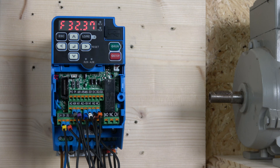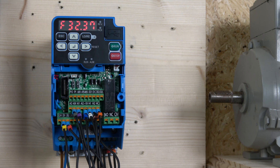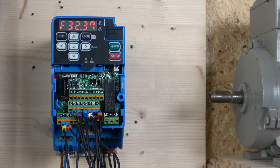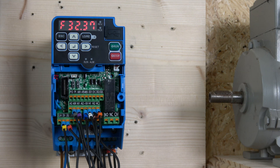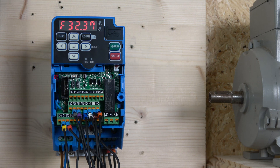Both forward and reverse are controllable by the potentiometer. That's how three-wire control is done. There's a lot more this drive can do — you still have four additional inputs, you can add jog, multi-frequency setup, and all sorts of other things. This is just to give you a good idea of how to navigate and set the drive for the most common applications. If you liked this video, smash the like button; if not, comment below with any questions and I'll answer them as soon as I can. Thank you very much for watching — see you in the next video.